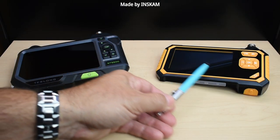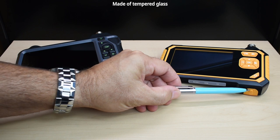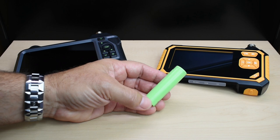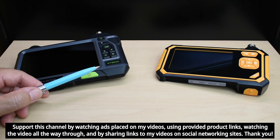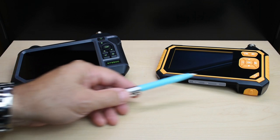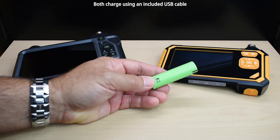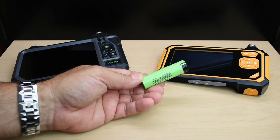This one over here has a 4¼-inch LCD screen; this one over here has a 5-inch screen. The older unit has a battery door that you slide open, and inside is an 18650 lithium-ion cell — it typically comes with a 2600 mAh — to power the unit. The NTS 500 has an internal battery that is not removable, with a capacity of 3500 mAh. This unit is designed to run between 4 and 5 hours, and the older one between 3 and 3½ hours. If you switch to a higher capacity cell close to 3500 mAh, the run times will be very similar between the two.